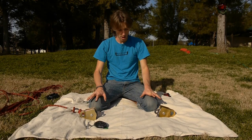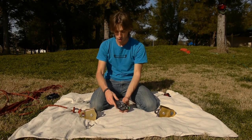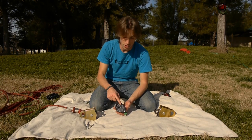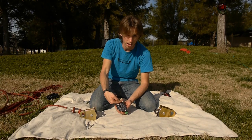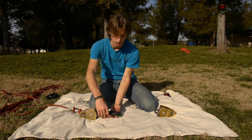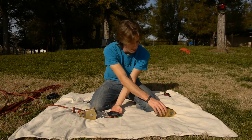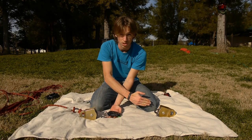The method of actually reaving the pulleys depends highly on what brake you're using. You want to figure out what side of your brake the tail is going to be coming out. I'm using the Edelrid Eddy here, and the tail comes out this part of the device. If I'm embedding the brake like this inside the pulley system, the tail is going to be coming out closest to me, so I want that last strand coming from the moving pulley to be on that same side.